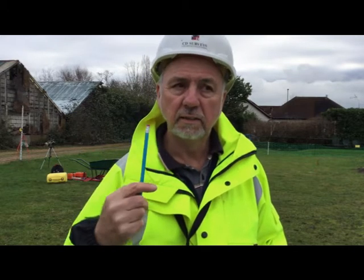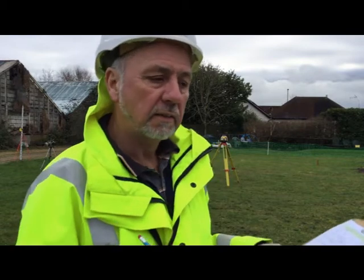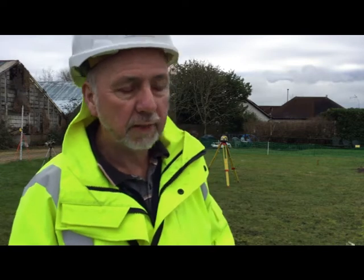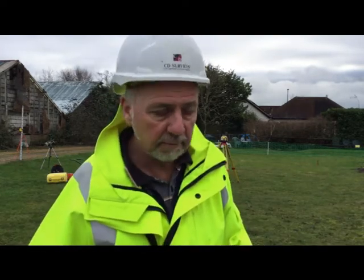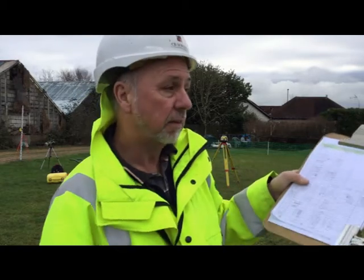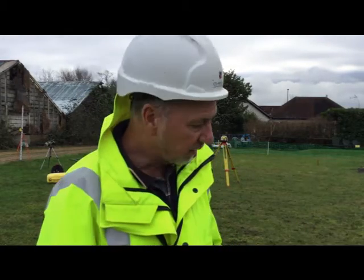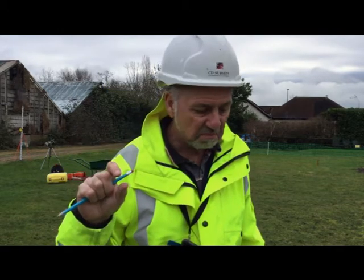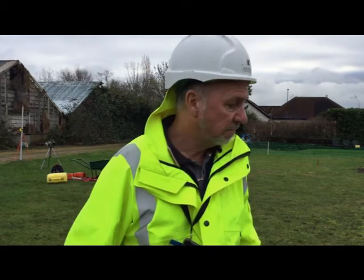So this was an example on how a rotating self-leveling laser compares to an accurate automatic level, and providing you do both with a reasonable amount of care and the environment that you're in, you should be able to get within a few millimetres of your intended levels. And as this is rough ground, I would say anything within 10 to 20 mil are fine.